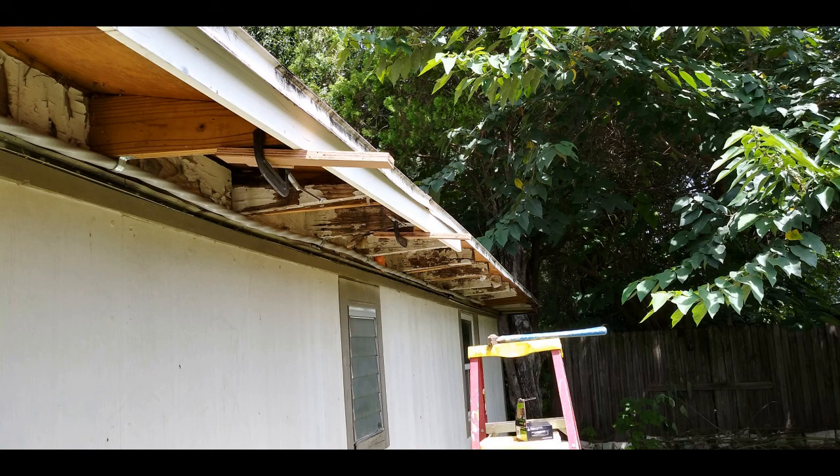As I worked my way down the roof, I ensured that I kept the fascia tight to the roof and the rafter tails. In this case, it caused a little waviness, but the house isn't exactly square. Another option is to run the fascia boards wide and cut them after the fact, leaving a nice clean line. But I'm not a fan of running a circular saw over my head.